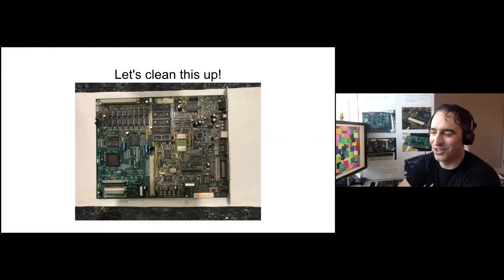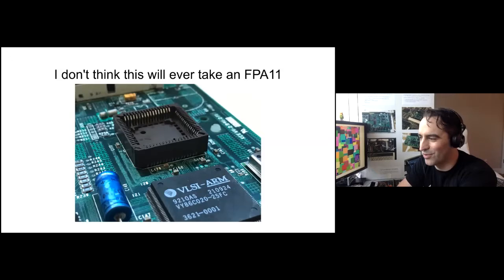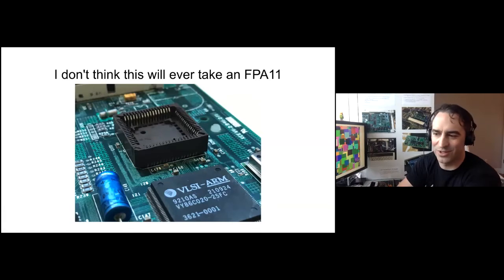With the board out, everything to the right of the ROMs and the podule slot was fine, but everything to the left was just disaster. I had to cut the drive cables because they were so corroded I couldn't even unplug them from the sockets. I got to work: vinegar, scrub with a toothbrush, water, let it dry — still looked awful. Did it another two times. Still in pretty terrible shape. You can see those traces between the CPU and the FPA socket are awful. In hindsight some of that greenness might actually be solder mask, because when I peeled off some solder mask under the crystal, the traces were rusty with the mask peeling on top.